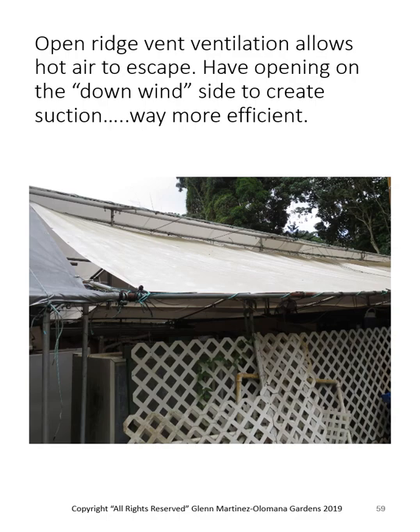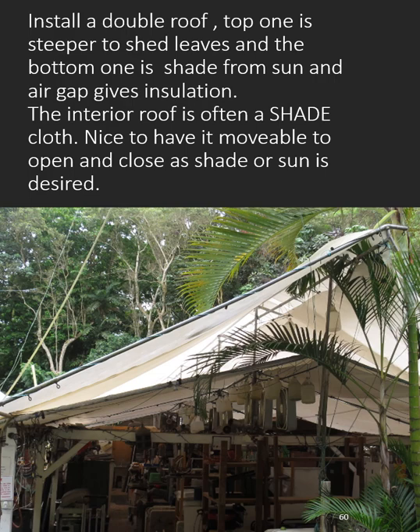Here you see venting down a ridge vent. One side comes up and over — the opening is one foot over and the eave is two feet. I have never had the rain blow in. On this building the tarp on the left is 16x24 and the one on the right is only 12x24 at a slightly lower angle, which provides the air gap. Also pay attention to the water bottles — since I don't use bungees, I need to put tension on the tarp, so I take a $2 juice bottle, fill it with water, and hook it on. I've never lost a bottle, though my bottles are not UV-rated and some are starting to age out.